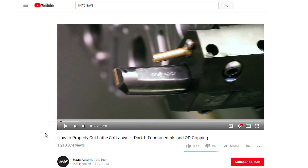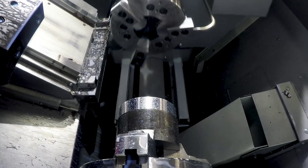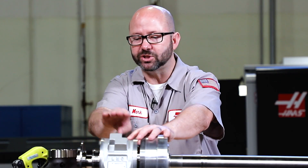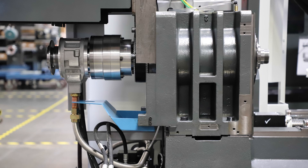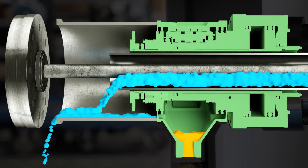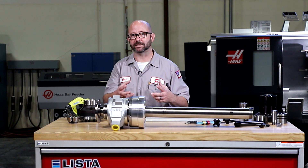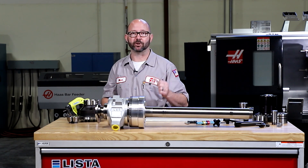You can also try making your parts in one operation, running from a piece of bar and using a cutoff tool to control your length, or run it on a machine that has a sub-spindle. We've given you some great methods on how to locate your parts, but here's one method you need to avoid: some shops have created their own stops that mount on the back of their actuators — don't do that, as it will void the warranty on your clamping union. First, some of these stops actually trap coolant behind the actuator, which then has nowhere to go but inside the hydraulic union, contaminating your hydraulic fluid. Second, loading parts too firmly or using a pullback style collet system can put tremendous force on the housing, causing bearing damage or causing the union to crack or split.